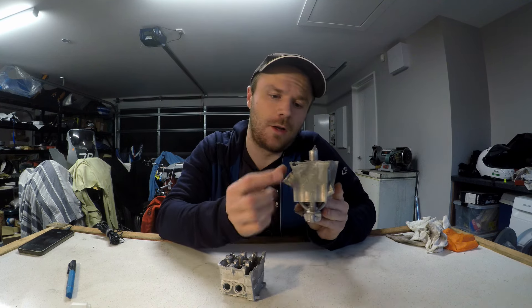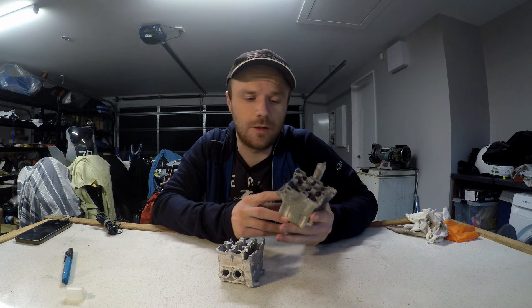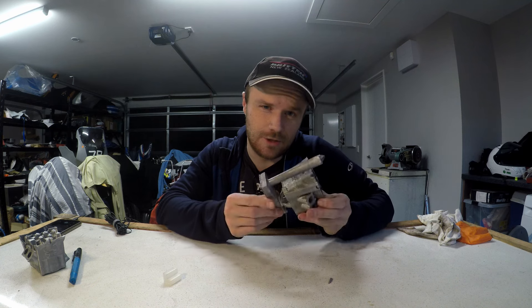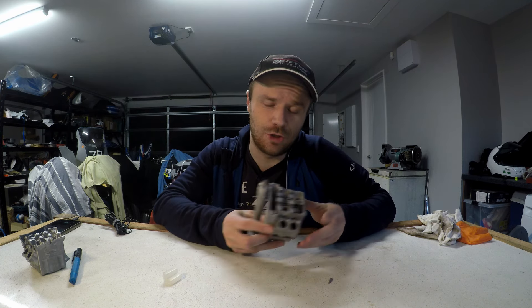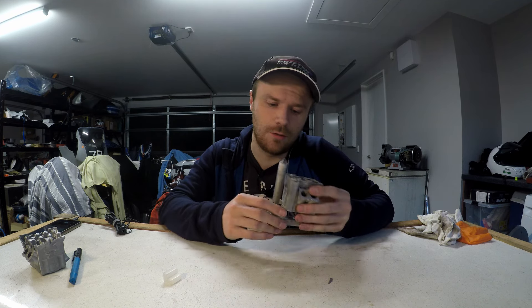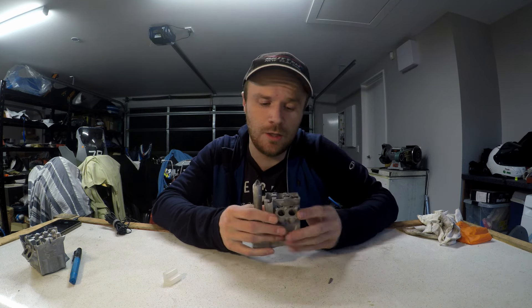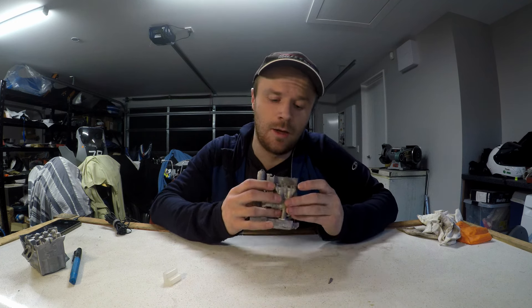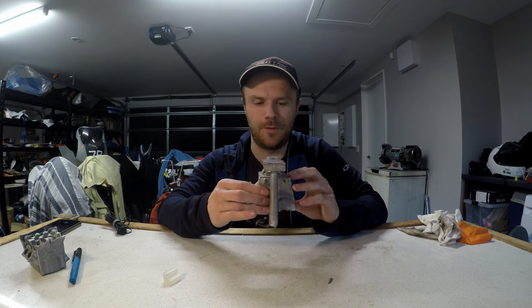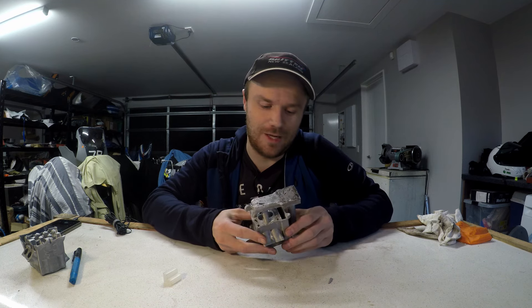This side is almost perfect and there's a couple of areas where there's been some shrinkage or it's not filled in correctly, so I need to sort out why that is happening. I've left the gating system attached to the cylinder head — my plan is to do some test machining, using this as a reference. I'll deburr the 90-degree edges, make sure they're as flat as they can be so I can clamp it in the vice on the milling machine, clean up the top, then cut this off. But things here never turn out that simple.